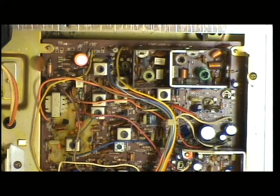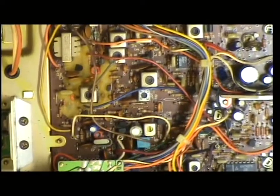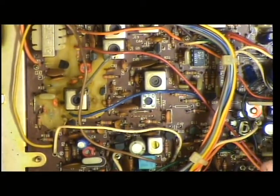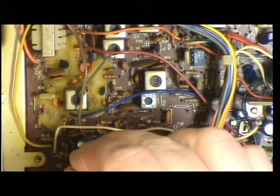Right, I just want to make sure it's now on frequency - we know it's off frequency from when we were setting the VCO up in the other room. My Twiggy tool has lost its end so I have to use the wrong tool. CT1 is the one down there next to the crystal. It's difficult to zoom in closely on a base station because it doesn't fit the bench very well - it's as big as we can really accommodate. Of course if there's less clutter on here it'd be easier. So we're on channel 20 UK, so it's 27.79125 MHz.